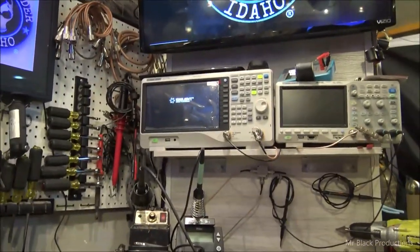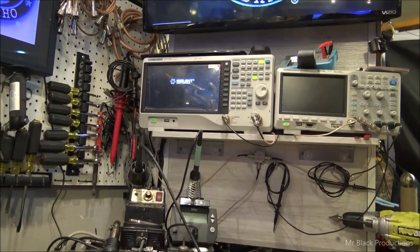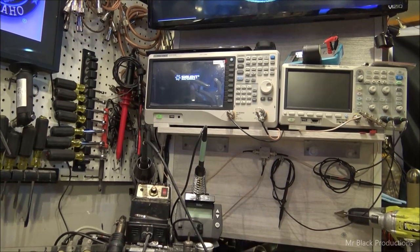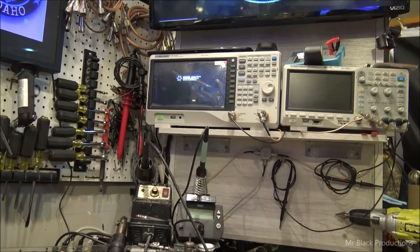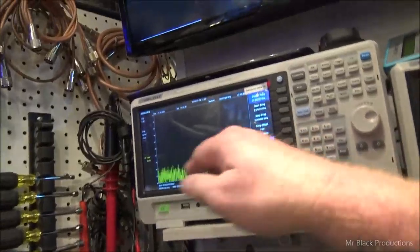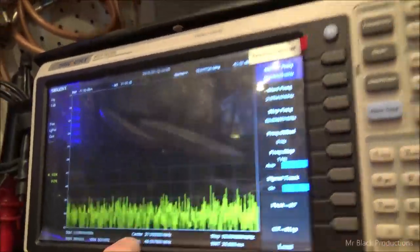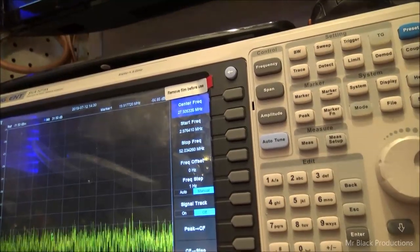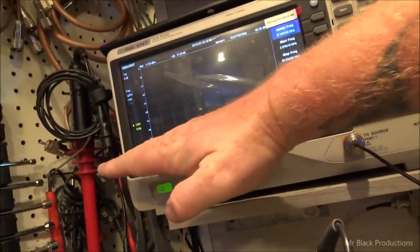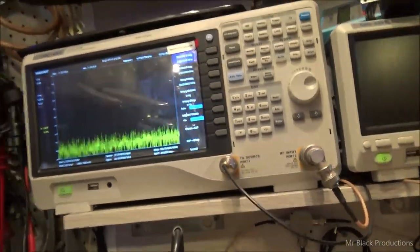And we're going to turn on the spectrum analyzer. I'm going to explain to you how to read this here in a second. Boot. Come on, boot. Okay, so the span of this thing is, start is 2.67 megahertz, center is 27.50, otherwise just above the 11 meter band, and stop is 52 megahertz. This shows us all of the signal all the way across the band, from almost all the way down at 0 megahertz, the CB frequency, and then well outside of resonance.